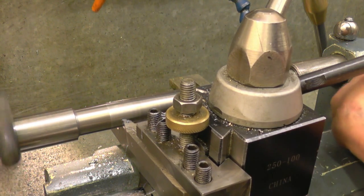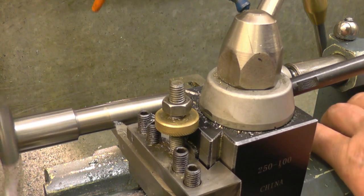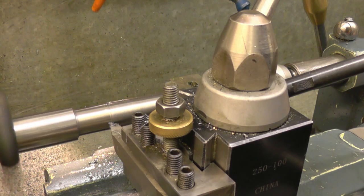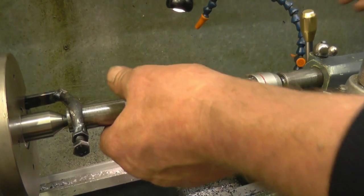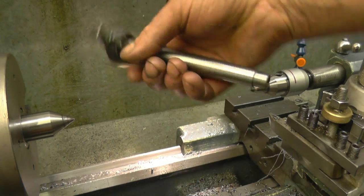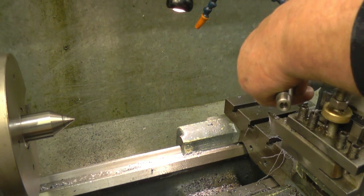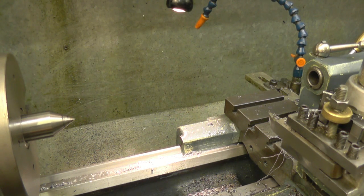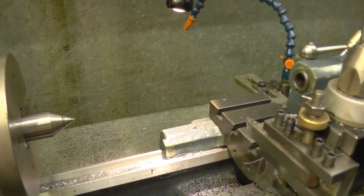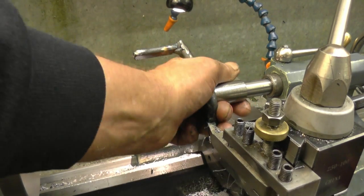It's not taking much off, but it is taking metal off. You'll see once you start to get near the size on the taper it takes very little to go too far in. One of the issues is the lathe is worn — it's getting tight as I get near this part. That's quite a nice finish. One thing about machining between centres — I can put that back in and it'll be exactly where it was before.